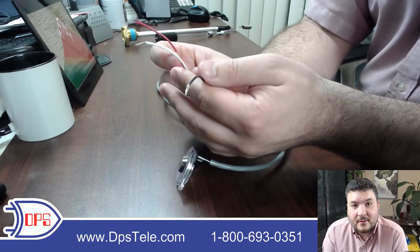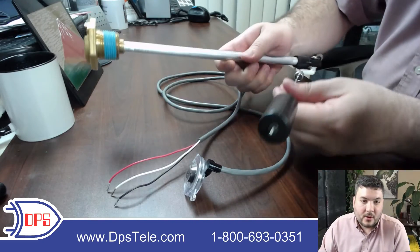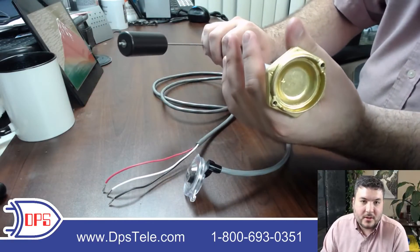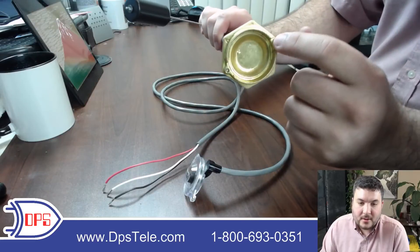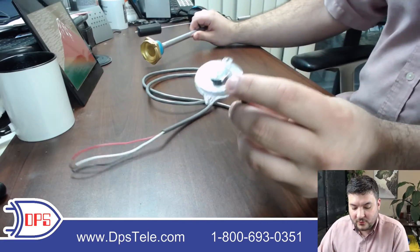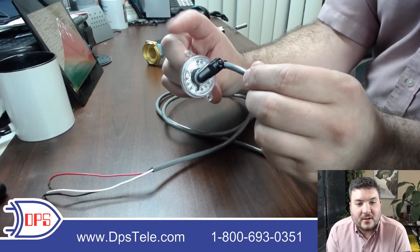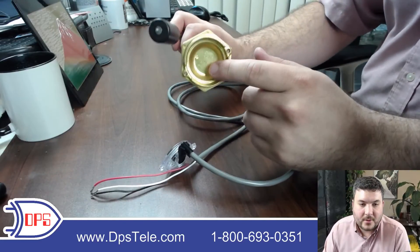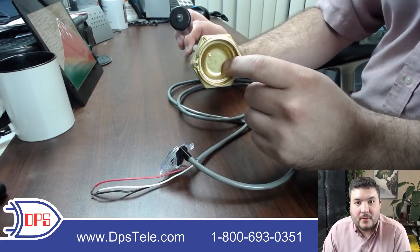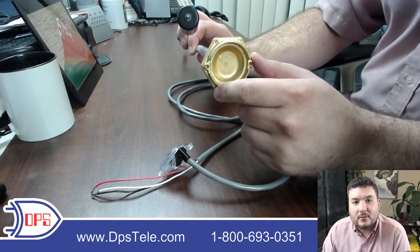That's really all it takes to set up propane monitoring. It's quite convenient — you are most likely not going to have to drain your tank, as long as you have a float with this sealed magnetic operation where you don't need to do anything other than pop the gauge off the top. You do want to be careful about size: there are Rochester Junior and Senior gauges — Rochester is the manufacturer and they make two different gauges that are only about 20% different in size. So measure the top of your tank to make sure you get the right model. Other than that, just remove the old gauge, insert a new machine-readable one, and connect it to a remote monitoring RTU like the NetGuardians that DPS manufactures.